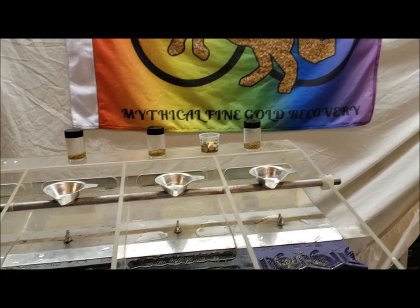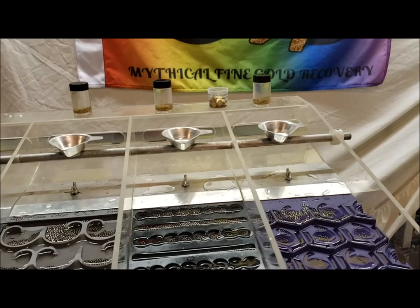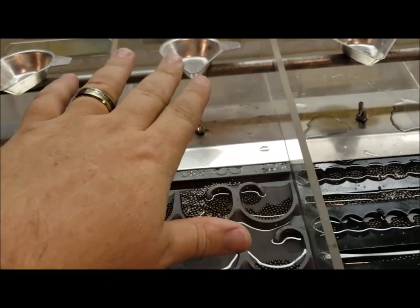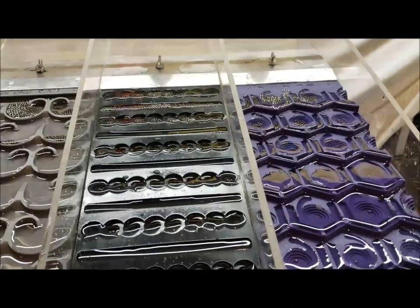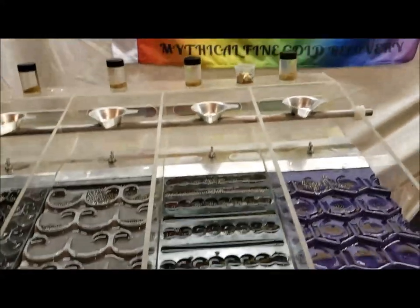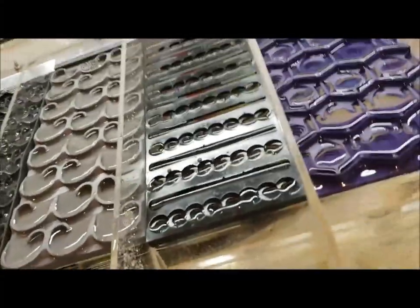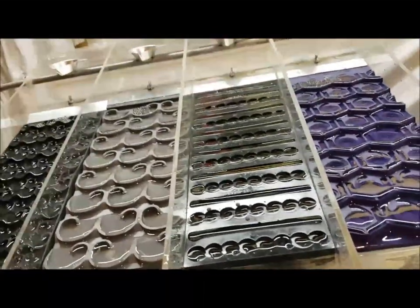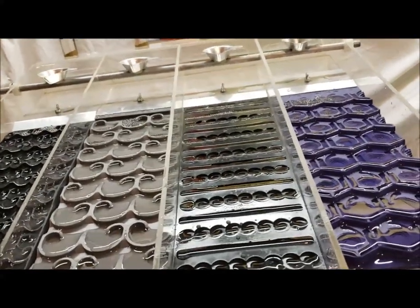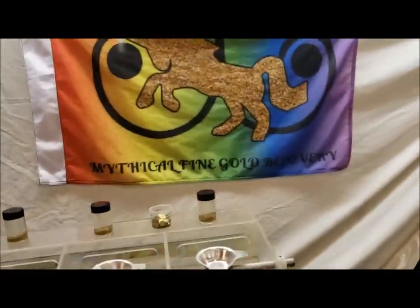We just have to come up with a little idea, like a little auger or a vibrating sieve on a pan that's got a pointed funnel, and get the material to come off at a steady rate. So the material is fed at a steady rate, and it can be controlled. We'll get that dialed in so it'll be repeatable, so no one can say you scooped it heavier in this one than in that one. We'll have the same angle, same flow, and the same dirt, and we'll run them and solve a lot of what people say, like, well, if it had dirt in it, it would act different. We'll see who's going to be the winner.